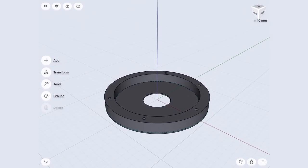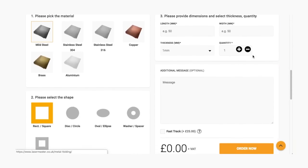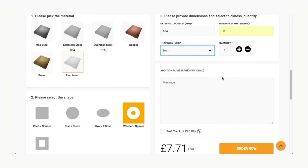The aim of this design is to make it as lightweight as possible — the lighter it is, the more realistic playing feel we'll get. The metal components were made by a company called Lasermaster from the UK. They offer all kinds of metal cutting services and have a simple online configuration tool. I decided to go with 2mm aluminium for both rings. Aluminium is very lightweight and easy to work with.